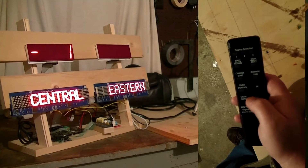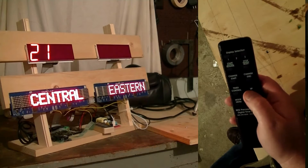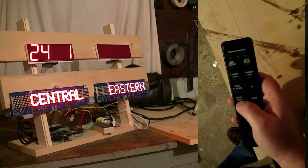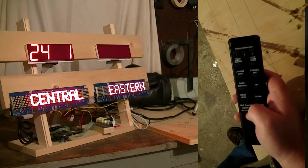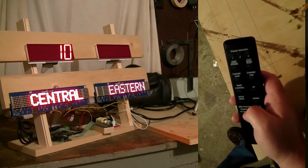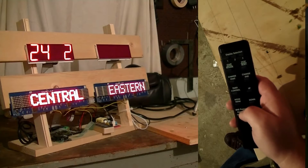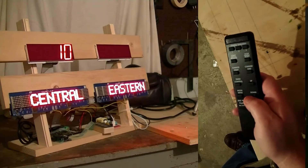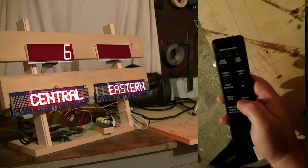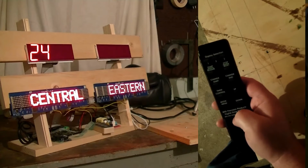For Zulu it should be zero, so I'll press down two times to get back to the top level menu. I'll press up and go to 24, then mode menu one time. Mode 24 is where we set the DST, and the one means we're doing it for time zone number one. It's set to ten — for this clock ten is correct. I'll go up to two — ten would not be correct for Zulu. For Zulu there is no DST so I'll change that to zero, then mode menu and press down two times to get back to the top level.